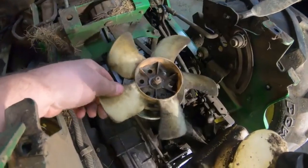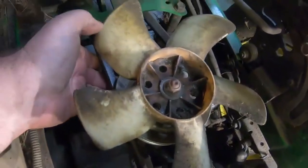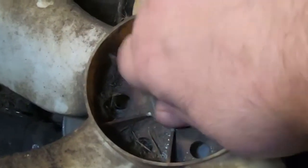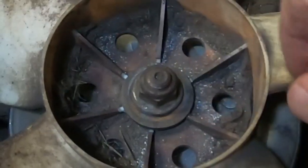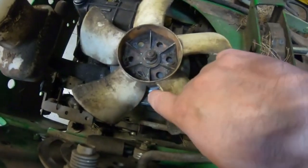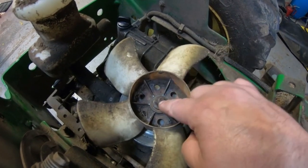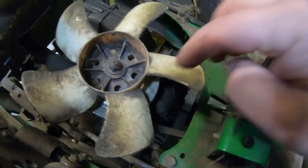When we get in here, I can see this fan is loose and the pulley is definitely loose. We'll pull this nut off and see what we've got to work with. This nut here is loose — I can actually turn it with my fingers without even having a wrench on it, and you can see all the metal down here. This pulley looks newer, so I'd say it's been replaced once before. It's likely this nut wasn't completely tightened down. I'll get this off and show you a real easy way to get this belt off without messing with any of the springs or anything underneath.